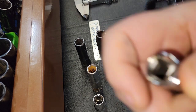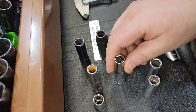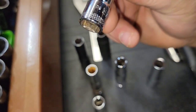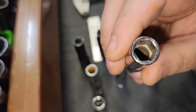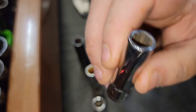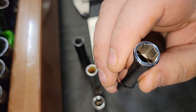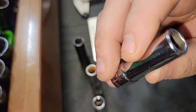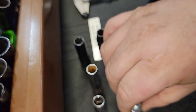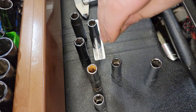This socket has a recess, with four sides for retention on the ball detent. Is it a terrible socket? No, but it's not my socket of choice. On a quality socket like this Mac, the broaching is a lot shallower — and I'm using Mac because saying the 'S word' will send harbor freight fanboys into a frenzy. I don't know what Snap-on or Harbor Freight puts in the water, but those harbor freight diehards are just out of control. Anyway, the shallower broaching is what matters here.